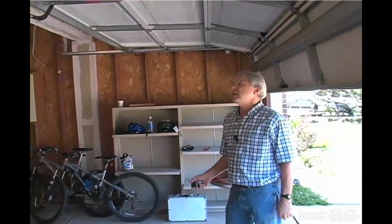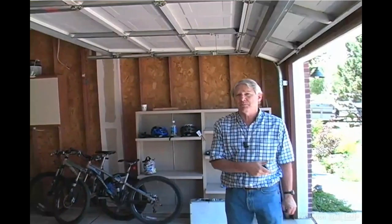And this one was pretty reasonable. You may find some that are really hard to hold and you should just let go and let them come on down and write it up as needing adjustment. Photosensors were designed to protect little children, and so they should be mounted a maximum of 6 inches off the floor. They were first required in 1993, so homes that age or newer, you expect to see them. You should mention them if you don't.